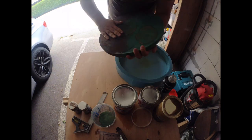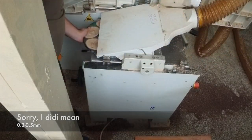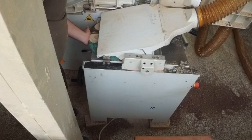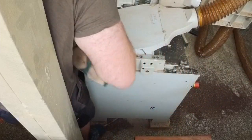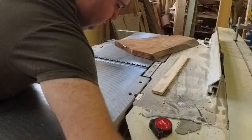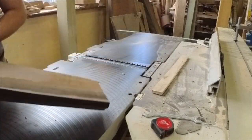After 30 hours it was solid as a rock. With the thickness planer I was removing 3 to 5mm in one pass, but I think it was too much for the end grain. When I pushed it in I knew something was wrong. Oops. If I would have video of me after this disaster you would see just a poor headless chicken running in the woodshop.